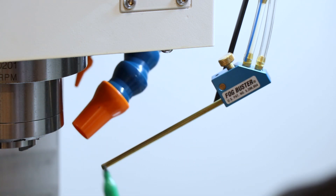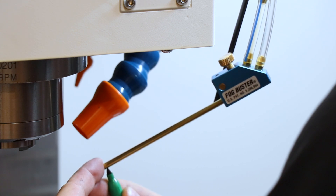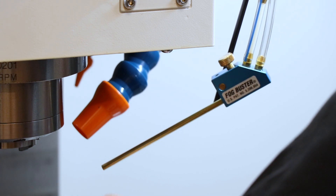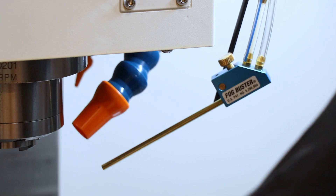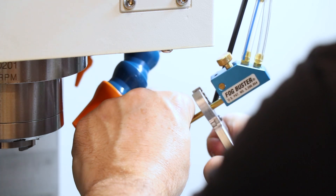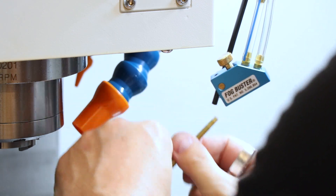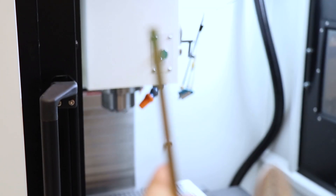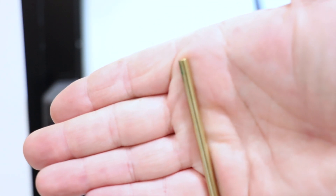What we're going to do is use a green Sharpie — we're just going to mark the bottom edge of this nozzle so that when we put a bend in it, we know exactly where that bend is going to be after it's threaded back in. So I'm just marking it with the Sharpie. Next, we're going to take it back out the same way we put it in. We now have an indexed location so we can bend this thing in the correct orientation. You can see we have a nice green line along the bottom edge.